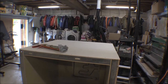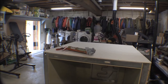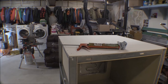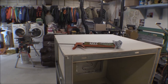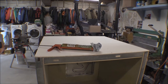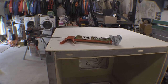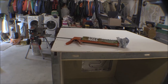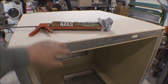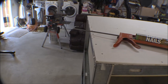The sheetrock would make it rigid but since it's so fragile the screws are liable to pull out. These pieces of sheetrock were kind of rough — the last three pieces at the lumber yard, crushed and broken in a few spots. So I put quite a few screws in them but I also glued them down with liquid nails. That will fill in the gaps and seams and give a continuous bond to that sheetrock wherever it's applied, all the way around the perimeter and down the centerpiece — better than the sheetrock screws alone. I used one-inch fine-pitch sheetrock screws recommended for steel studs, but in a couple spots I overdrove them and they cracked and pulled the piece a bit.